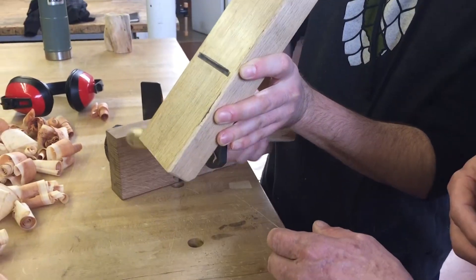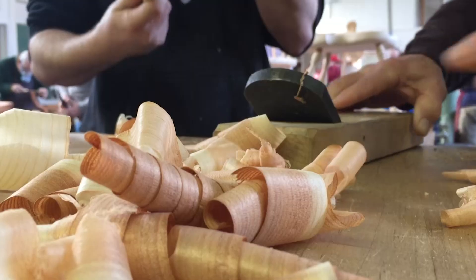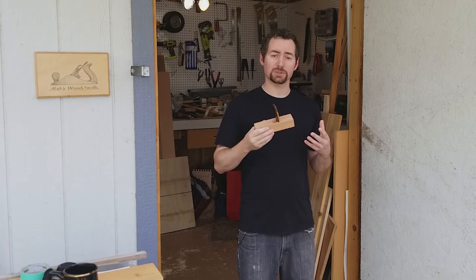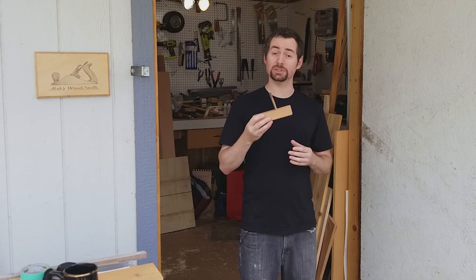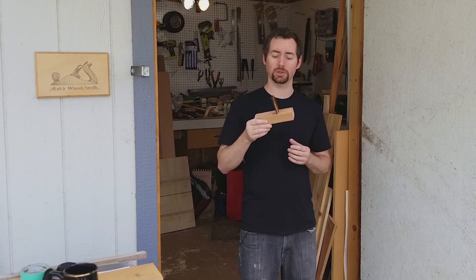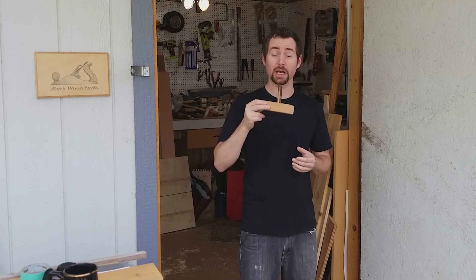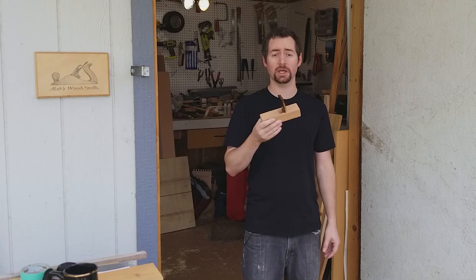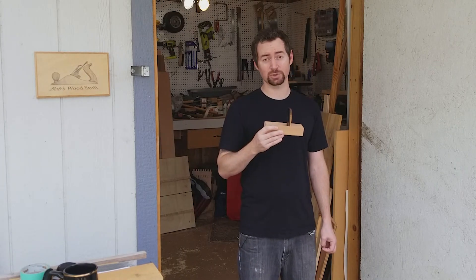Once the kana is tuned up well it can make some nice thin shavings. This was a surprisingly easy build — quite a bit easier than building the full size Japanese hand plane — and it works quite well when I keep it sharp. Because of the angle of the bevel it stays sharp for a long time. I highly recommend making one of these, or buying one if you don't have one and you're using a Japanese hand plane. Thank you everyone for watching and please like and subscribe.